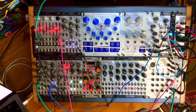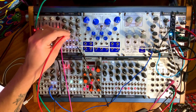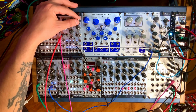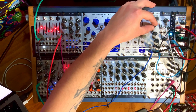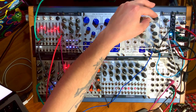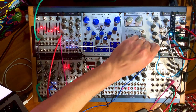Here's another idea: let's modulate our Filter 8 LFO with the sequence, and that's FM-ing the internal oscillator of the CDVCA. A little drive — the drive kind of nulls out the effect of the internal oscillator. But we do get a timbre change when we change the center frequency.